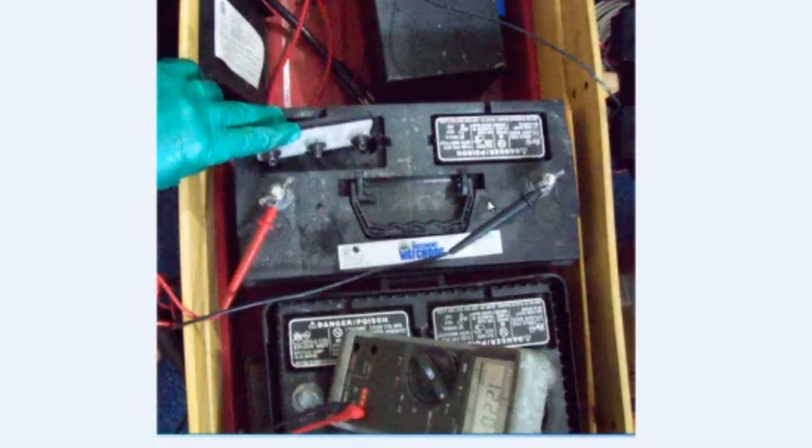There are a variety of chemical make-ups and plate compositions used for lead acid batteries. In this particular type we have a true deep cycle battery. Unlike a maintenance-free car battery or a starting battery, it's going to lack a little bit of calcium and some other additives. A 100% state of charge would show a voltage near 12.6 volts; near 12.45 volts for all six cells collectively would be about 75%. The 12.2 volts we read is right under 50%, so this battery has a 50% state of charge as measured by the open voltage reading — it is a totally floating battery.